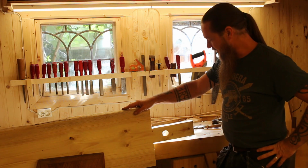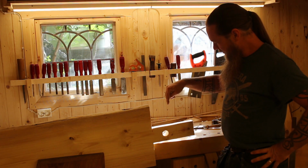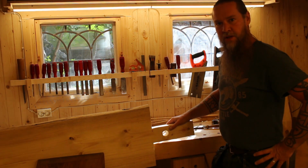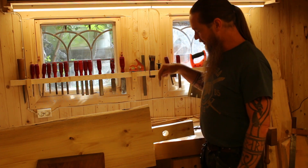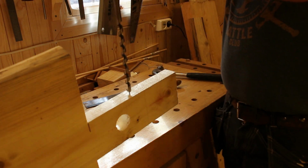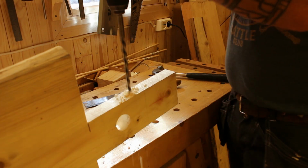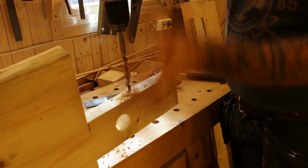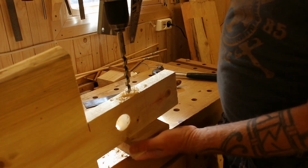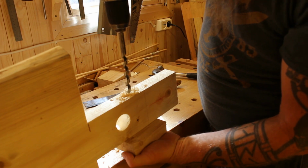The gable planks are pretty straightforward since they only have a single tenon. Just a matter of drilling through, pegging, cutting and finishing. The side planks I will have to do the first one and then flip it around and do the second one from the bottom. Holding a block of wood underneath will probably reduce tear out.